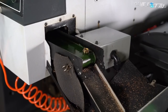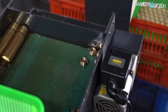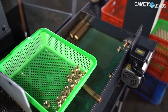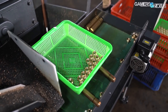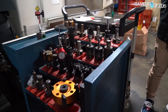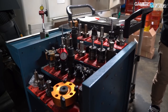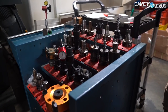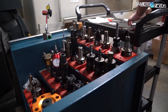Once all of the machining work is done, the fitting is spat into a short conveyor belt and dropped into a bin to await technician inspection. Each piece is placed in a drain for the oil to drip off and then inspected for quality control. Out of every million pieces or so, the defect rate is about 0.3% at this stage in the pipeline, making this one of the most accurate processes we've seen yet. Defects are typically caused by the bits slowly going bad, a natural byproduct of a whirling bar of hot metal getting pressed into drill bits constantly.